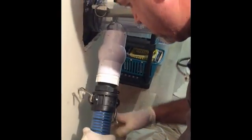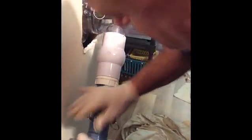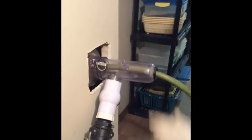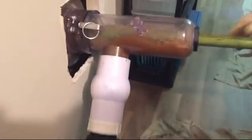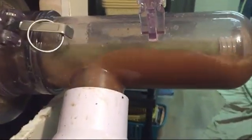Getting our can set up for our discharge hose. We've coupled on our two-inch discharge hose. Without jetting, this line has a lot of scale on it — we need to remove all the scale prior to the cast iron connection. You can see right there we have a rubber grommet. We're jetting at 4,000 PSI, 18 gallons a minute, with no leaks off the backside of the driver.